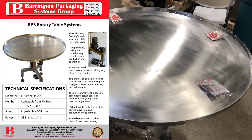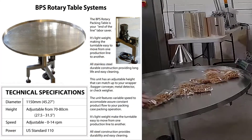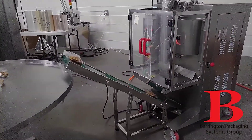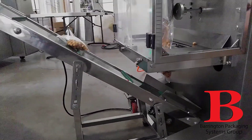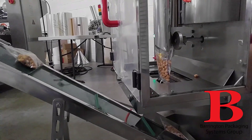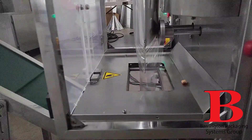There are other options that go along with it — you can do a hole notch, you can do gas flush, and you can dramatically reduce your labor cost. This particular machine was doing a 4-ounce bag, but it'll also do a 16-ounce bag. And with the appropriate cups and forming tubes, you can get down into snack sizes or small packages as well.